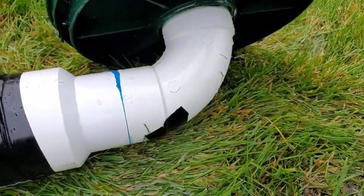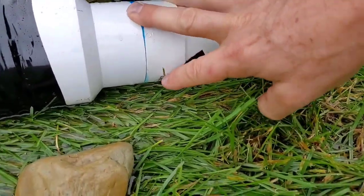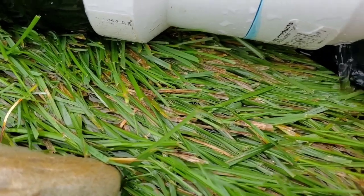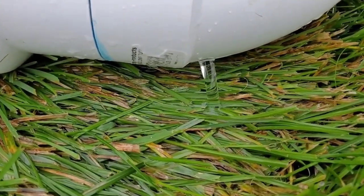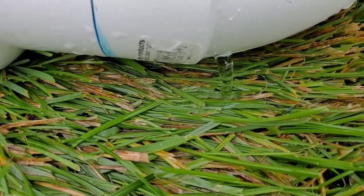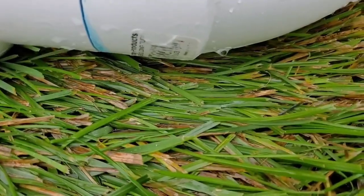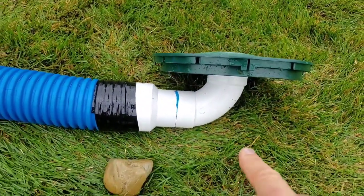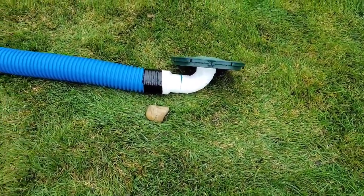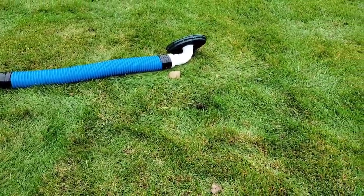This is why I encourage the three-inch when you don't have big tree leaves requiring a four-inch pipe. We cut little holes in the bottom of the elbow so it can leach too. It just pours out slowly and leaches into the soil. So when old man winter shows up, it's not an issue — the knife cut drains the last few feet of corrugated pipe on one percent slope, and the holes in the bottom of the elbow drain out the pop-up. That tiny bit of water will leach even in clay. That's why we moved away from drain basins — they just hold way too much water.